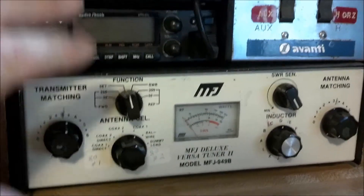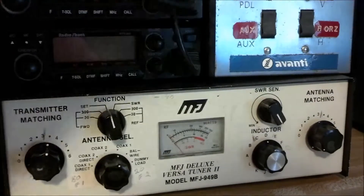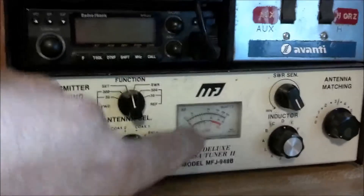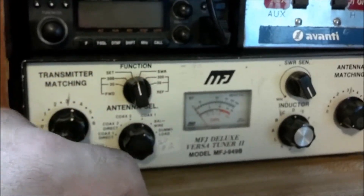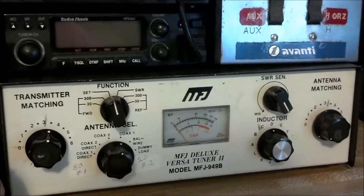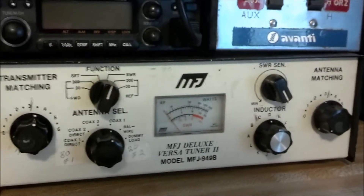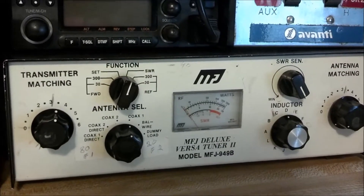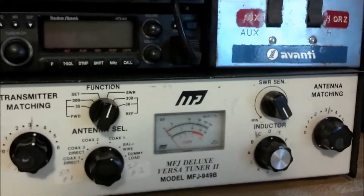your transmit power will go out of the antenna, but if it's not tuned properly you actually have some RF energy that comes back down into the radio - and you can measure that. We have a switch up here: when we turn it to SET and transmit, this needle will show us how much outgoing power we have. If we want to measure the Standing Wave Ratio, or SWR - which is the reflected power coming back into the radio - we turn this to SWR. That reflected power is not a good thing; you can damage your radio very quickly, and any power reflected back is obviously not going out transmitting.